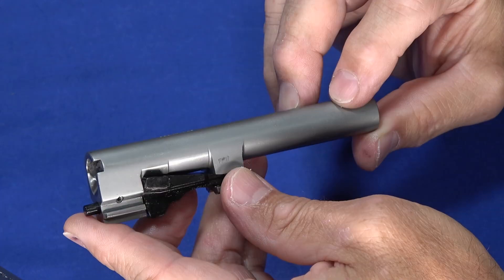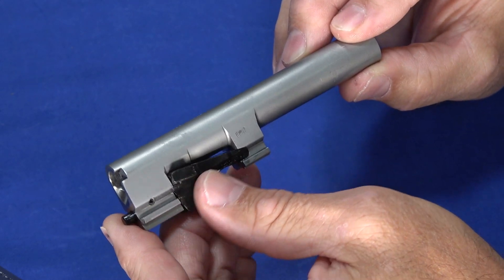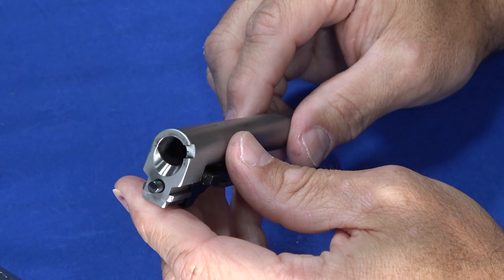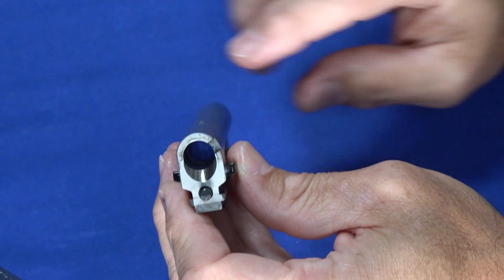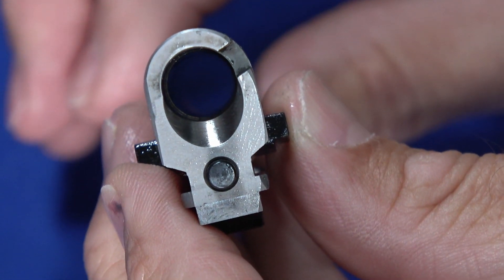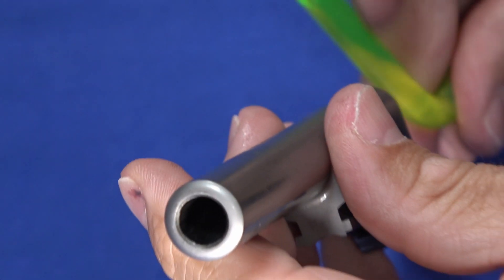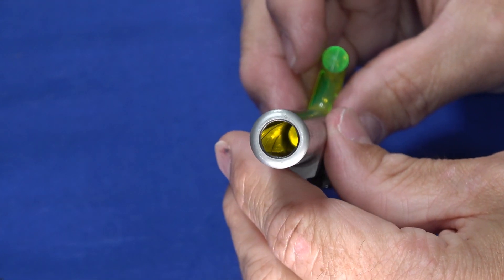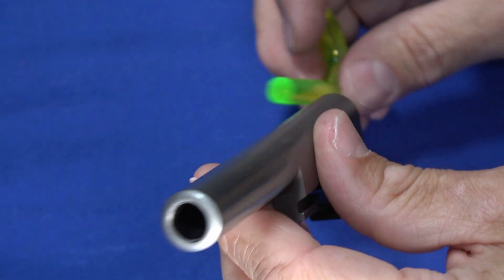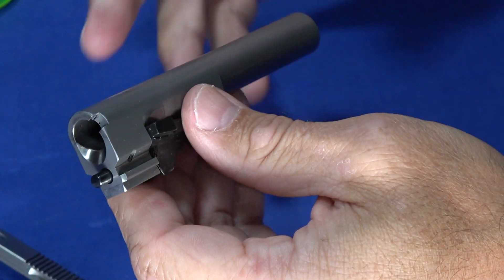Here you have the locking block mechanism that's characteristic of not only the entire 92FS series but that Beretta has carried into many of their other guns, and it's proven to work very well. It's a little more complicated than the locking-lug style like a Glock or 1911, but it's proven to be quite a good mechanism and is probably part of the reason this gun has really nice recoil characteristics. This locking mechanism delays the recoil impulse and spreads it out a little so you don't really get a slam in the hand. Nine millimeter doesn't have heavy recoil to begin with, but this gun has particularly nice recoil. You'll see a polished, relatively short feed ramp — this thing is very easy to run with any ammo and is not ammo-sensitive in any way. It's conventional rifling, well machined; everything about the barrel is well machined.